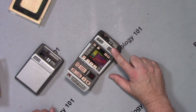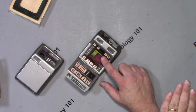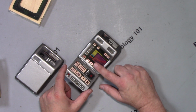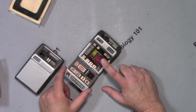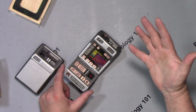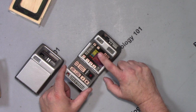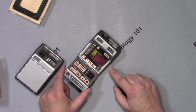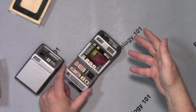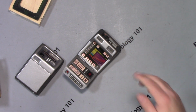So in the end, we continued after we made the first, I believe it was 10 or 12 of them, because half of them went to DS9, the other half went to Voyager. And the interesting thing about it was we continued to try and improve on the electronics. At the end of it, we kind of stopped trying to improve it at a certain point because we had battery power functioning for over 24 hours before it would start dimming and the sequencing lights would stop working, which is kind of strange that the sequencing lights would die before the constant on lights.